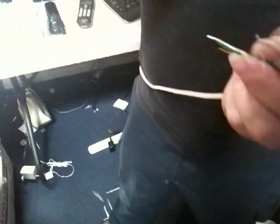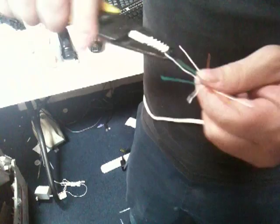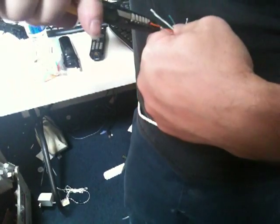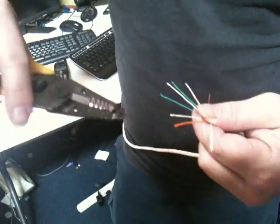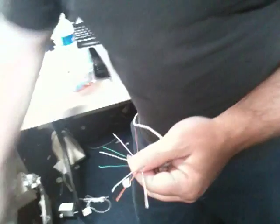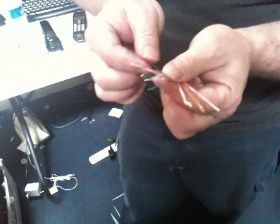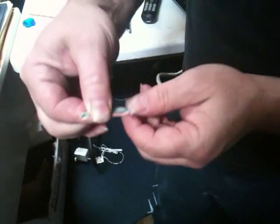What I do is I take another pair — this is the gentle part, you have to have finesse. Pull too hard on the wire, you snap the wire. You don't want to pull too hard, but you grab the wire and give it a little bit of a tug. The point is that you've straightened out all the wires now. Keeping your fingers pinched on the wires, you start to collect the wires like a deck of cards — fold them all in, but keep them pinched so they remain flat and don't start to overlap. That keeps the order.